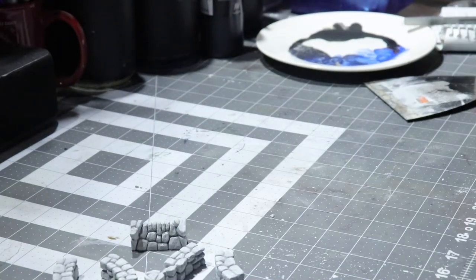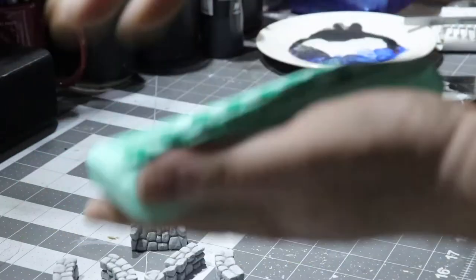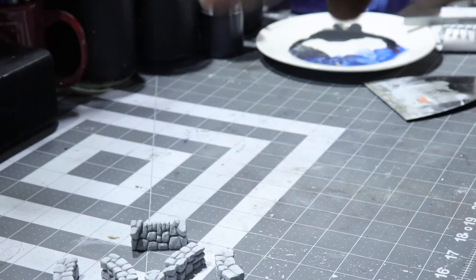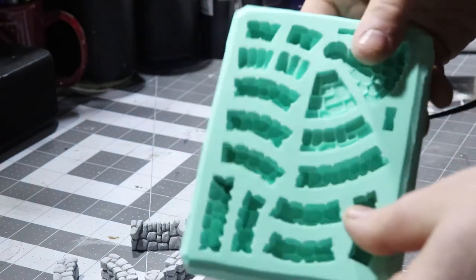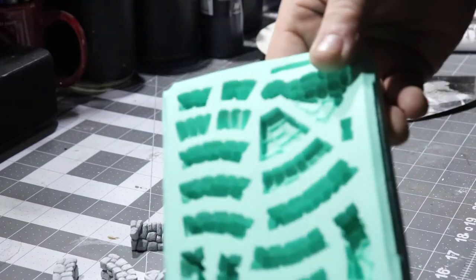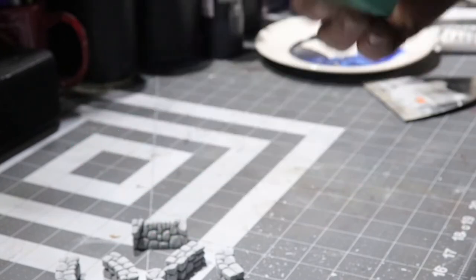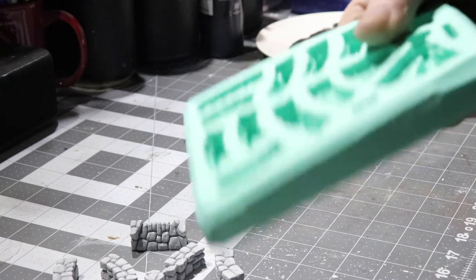Okay, now I will clean the surface of my mold using my hands like this, and when I'm done with it, smack it out to get rid of any dust or anything that might have settled inside. And we're ready for the next casting. So you spray it with your wet water again, mix up another batch of plaster and pour it inside, and then you'd be done. However, I'm done casting, so I'm gonna store this.